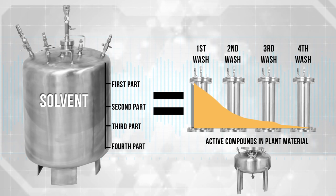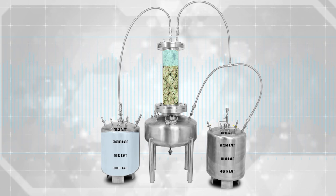Although these volumes are mentioned as separate actions, they flow through in one continuous cycle. Step 4: Soaking. Once you observe the solvent flow out the bottom of the column into the extractor tank, you can stop filling by closing the inlet valve on top of the column. Closing this valve creates a hydraulic vacuum on the top of the column that holds the solvent in the column area. The filter below prevents the liquid solvent from exiting the column. This allows you to soak your column with solvent for a specific time at a specific temperature to target specific compounds. If no soak time is desired, keep the column inlet valve open until the solvent delivery tank is completely empty.